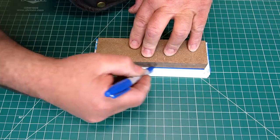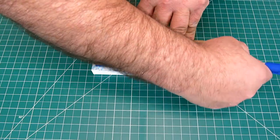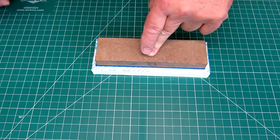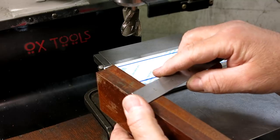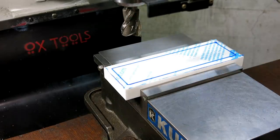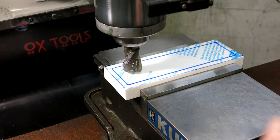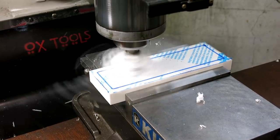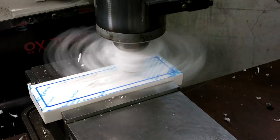I'm going to use Mr. Sharpie here and mark just to the inside of the line for our eyeball milling, which you'll see in just a minute. Let that dry just a whisker. Back at the mill — so how deep? Seven sixteenths deep. This stuff's a little thinner, so let's go half the thickness. I'll touch here, zero my quill DRO, and then go in about half the thickness. I'm just ramping it in — there's 200 thou. I'm just getting this material out of my way.